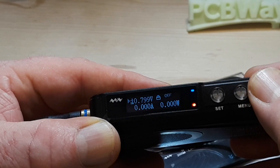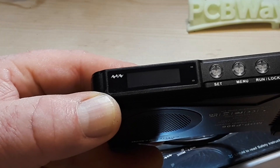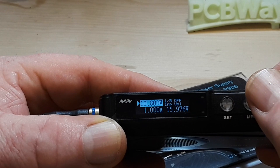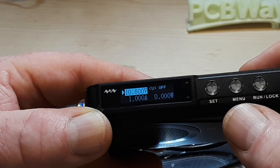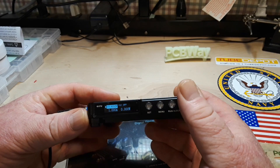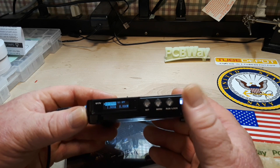There's got to be a faster way to scroll through these voltages — I don't know what it is. I'm going to power off the power supply and go to 16 volt input at three amps. Powering back up — coming in locked. Input voltage 15.97 volts. It looks like this thing has only 10 millivolt resolution on the wheel. If I wanted to go to 30 volts, that would take forever. It does appear to have velocity control though.